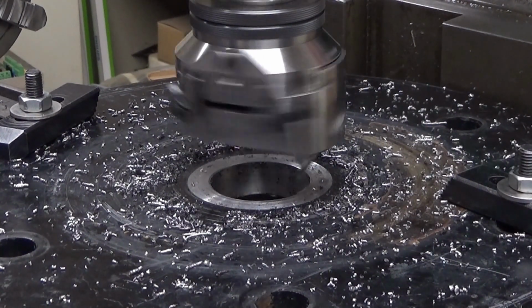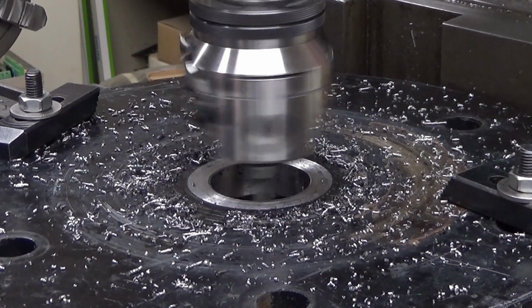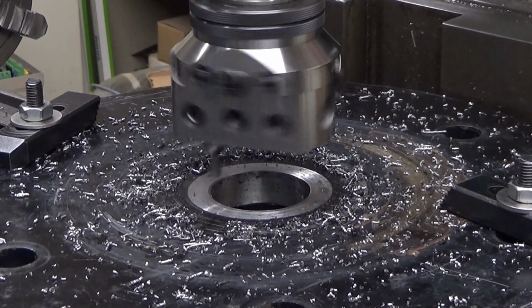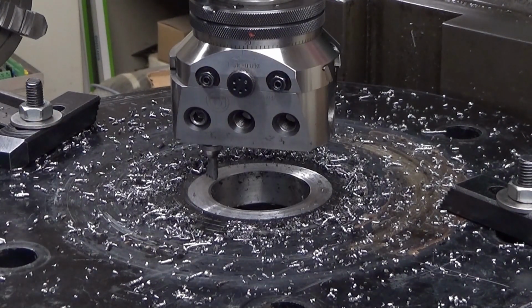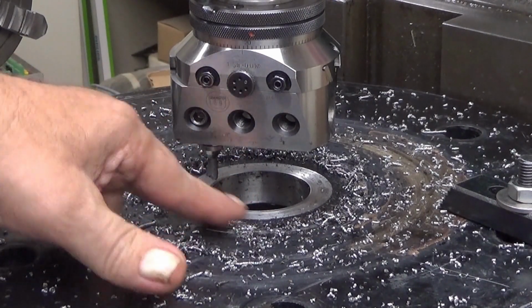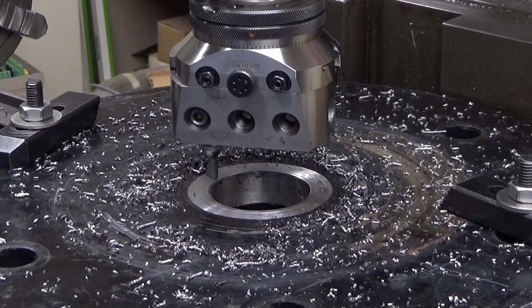A little bit more, to be consistent, so to say. There you are. Yeah. Well, this one is now ready. Then I have another identical, which I will also bore to 53 millimeters and do the chamfering and removing the paint and all the weldings, etc. So, yeah.